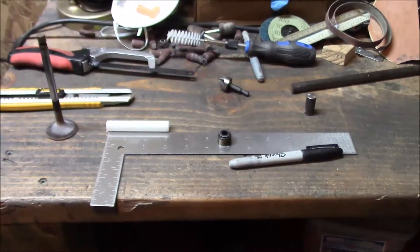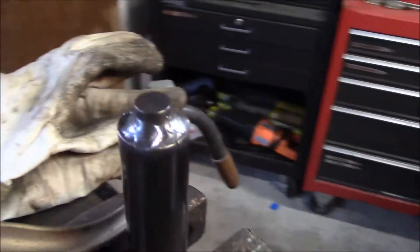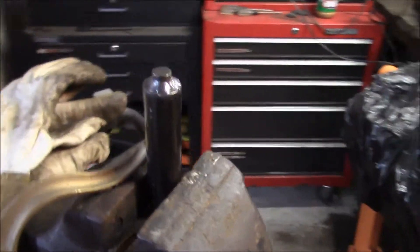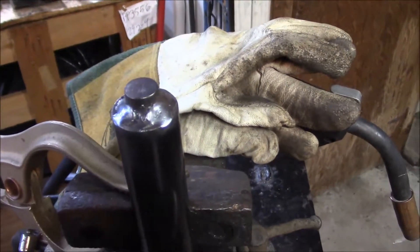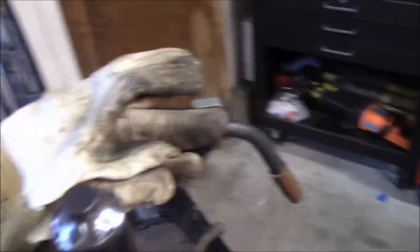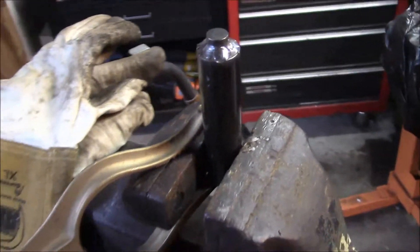So let me finish this sucker up and we'll try it out. I'll weld it up. Not as clean as I'd like — a few boogers I'll have to knock off — but she's good. It's still hot, but I think the Delrin's good; it didn't ooze out. I was actually thinking after I pressed it in, I probably should have made another pin tool to drive it in after welding, but I think we're good — I didn't see any smoke or nothing. The reason I wanted it to stick out so much is I don't want to grab it because it's hot — that way I don't hit my hand. And I think having a narrower tip is better for driving on straight with the hammer; with a wider one inch tip there's more chance of hitting it on the edge. So we'll let it cool off and see how she works.